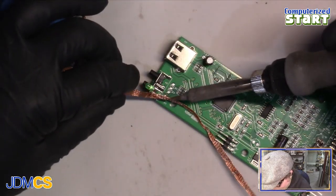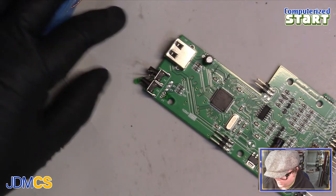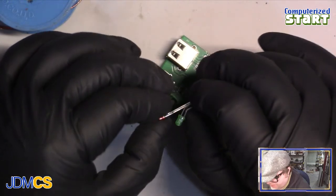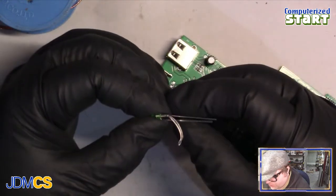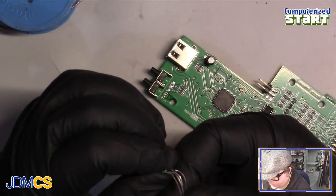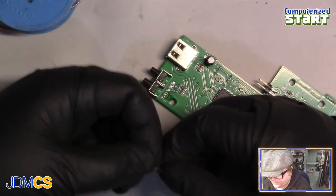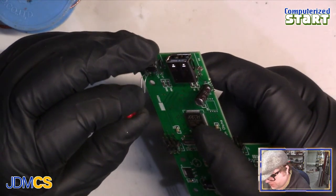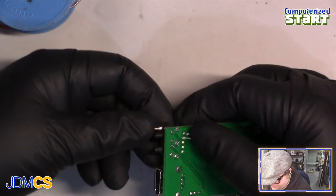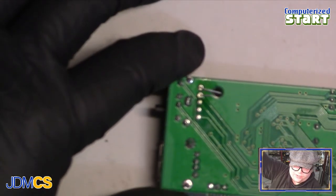And then the TRS-80 video that I want to do on the Gotek upgrade, now that one I put on hold, firstly because the one Gotek had a problem that was causing the OLED to flash, which was actually, I think, the Gotek continuously getting reset because of a short, which wasn't right. I wanted to at least make sure, if I figured out the problem was a hardware problem with the computer, to try to fix that. And if I'd figured out the problem was that Goteks just don't work on a TRS-80, then that would have been the conclusion of the video. But in reality, I'd determined that there was actually a problem with the Gotek unrelated to the upgrade. And also, I bought the wrong Goteks. So I put that video on hold until I could get the correct Goteks, which are the two I'm modding now.